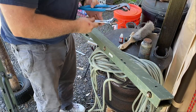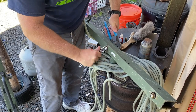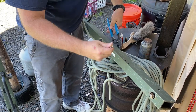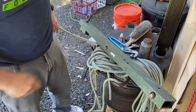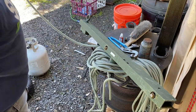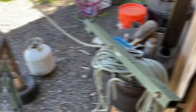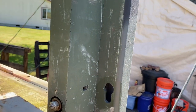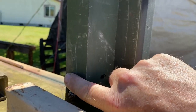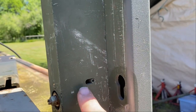Here's a little note to self: make sure that these are installed not tight, but a little bit loose — maybe about two turns away from solidly seated. Good thing the thread lock wasn't dry yet. You'll know that it's all the way in when this face is flush, and this is all the way towards the rail, and this is all the way through the rail.